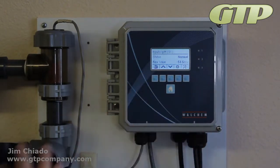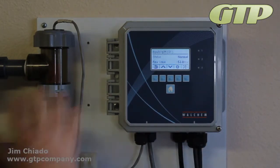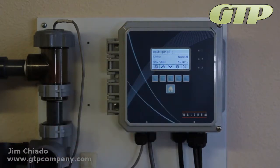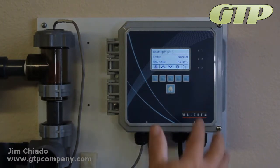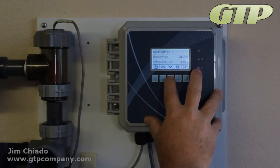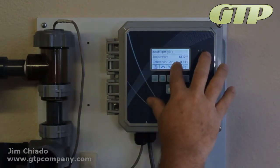Right now this is pretty close to neutral. If the system thought it was pretty close to neutral or zero millivolts, and you're really sitting at 10, you're not going to be able to calibrate it. We need this raw value to determine whether or not it is within range. Here is the last calibration.